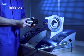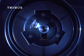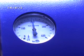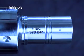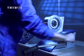To provide a quick and easy tool change, the basic Tribose SVP2 clamping device is available. The tool holder can be inserted conveniently. Using the hand pump, the proper clamping pressure is adjusted quickly and precisely. The clamping pressure is marked on each Tribose tool holder. Tools are changed in less than 20 seconds and ready to use immediately.